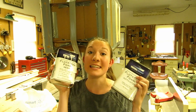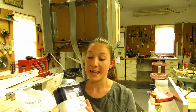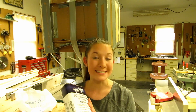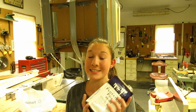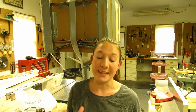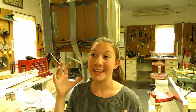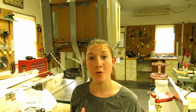I ordered these online — it's two-part polyurethane pour foam, and it came in within five days. I ordered it on a Monday and it came in on a Friday. Basically, you mix the two together and they start to react after 30 seconds or so, and then they'll start expanding. Before it starts to expand, I have to quickly pour it into the mold, and then it will take about seven minutes or so for it to expand to its highest peak. Then we wait until it is hardened and cured.